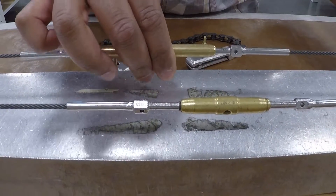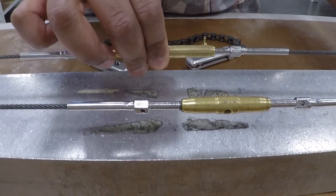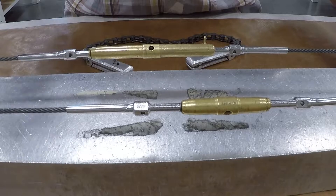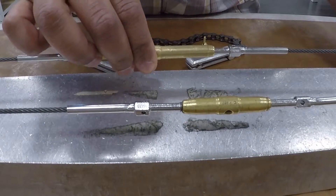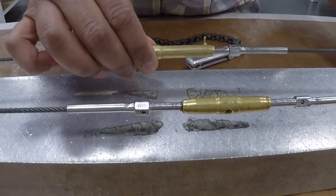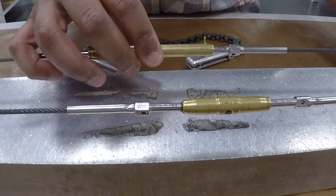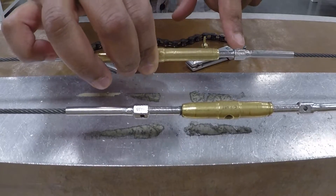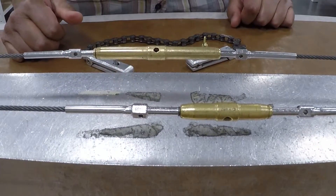See that? We do not want to twist the cable. We know the number one reason we damage cable is through handling — mishandling. That's the loosening direction, and you can actually see the cable wanting to twist. So I want to stop that.